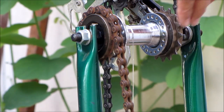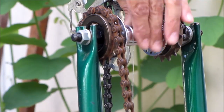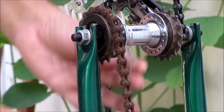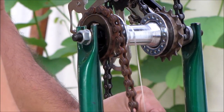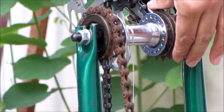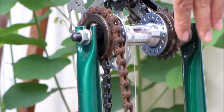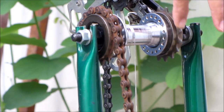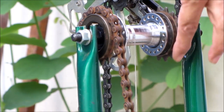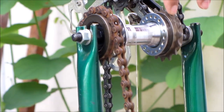With the locking ratchet fixed in position by the fixed chain, the axle now cannot rotate in any other direction except the counterclockwise one. When we apply a counterclockwise force on the ratchet, it rotates the axle together. But when the ratchet rotates in the clockwise direction, the axle doesn't move. This movement makes the nylon string wind up on the axle, taking the mass up.